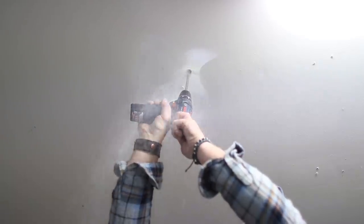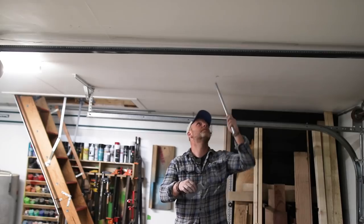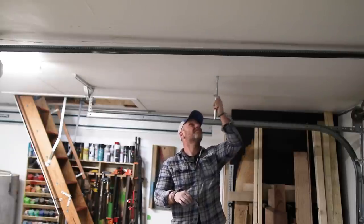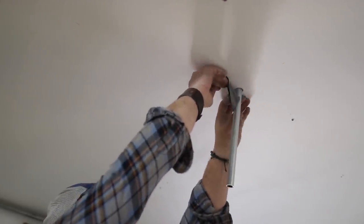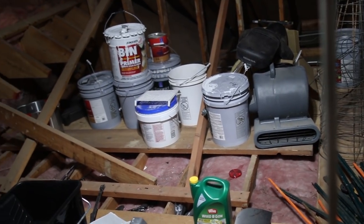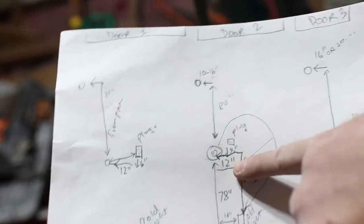After marking the locations of the new lights, I drilled one-inch holes in the ceiling to the attic so that I can get this clad wiring through the ceiling and then connect all of my lights together. This is going to work really well jumping from light to light — it makes it easy, you don't have to bend conduit. And to find the hole locations in the attic under all that insulation, I'm going to be using some conduit pipes through those holes and tape them to the ceiling temporarily. You can use conduit or dowels, anything basically you have laying around. Now we're in the attic and I have to find all of the pipes that I stuck through the ceiling, and I made myself a map with all the locations of the pipes in the shop to make it easier to find.